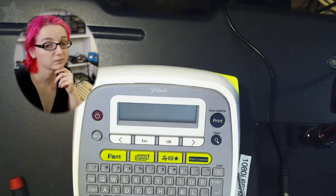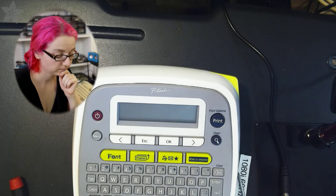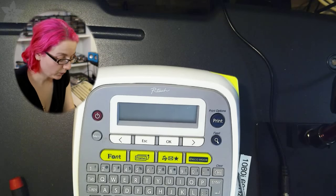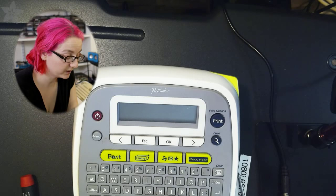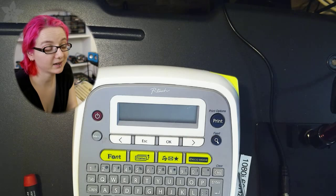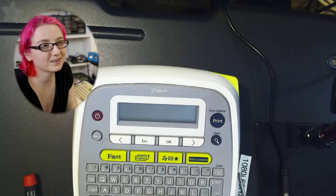Okay, next up. Question: for a similar device I have that's 9 volt, is it worth it to get a buck converter if I have 12 volt wall warts in place in the battery compartment, or just go buy a 9 volt wall wart? Well, it depends a little bit on the design, on whether it's direct power or there's a linear regulator in there. I looked inside of here, and it didn't look like there was any regulator, so I would hesitate to power it with anything other than 9 volts.